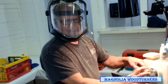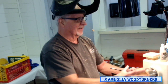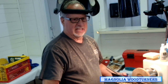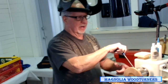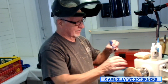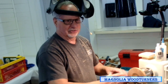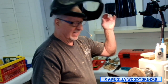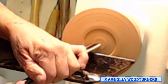Another trick I learned from John Jordan: do you have a set screw to keep it from unscrewing? You don't need it. If you lube your spindle and the spindle faces — wipe all the lube off, it always leaves a microscopic layer — put your chuck on hand tight, tighten it up, push it like that. It will lock on and won't come off, and it's just as easy to get back off. In all the years I've been turning, I've lost one bowl turning in reverse — a 20-inch bowl. I guess I had too much friction and it just came loose and hit the rest. Didn't hurt anything, but it was scary.